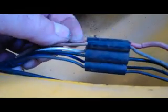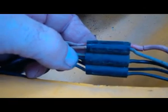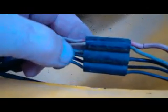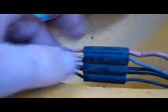I'll pull this connector apart and look for corrosion. The red wire is positive battery power, the black wire is ignition — it puts power to the coil, which is grounded using the points. The brown is the reversing solenoid, the gray is the start solenoid, the white going to yellow is a neutral indicator, and blue is for the generator light.